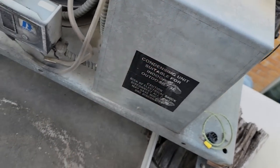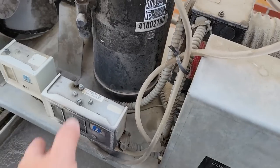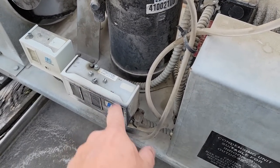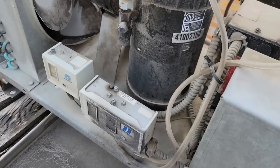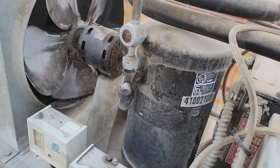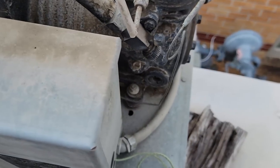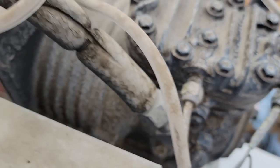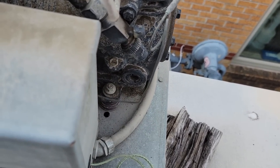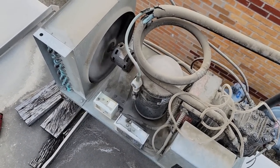The evaporators are running down below. And I'm kind of just wondering, do we have a fan? Yep, might have a fan out. High pressure switch trip. Looking at that fan motor there, looks like it very likely could be bad. A couple of bad gauges on it. Ooh, look at that. That's not good. Holy mackerel. That's gonna be snapped off. The fan came on, but I still have my lingering doubts on it.